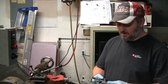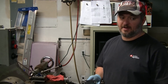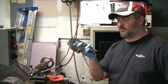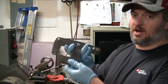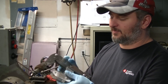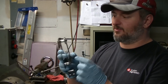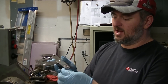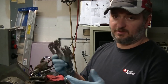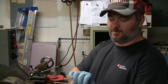As most of you may know, if you're following along in the series, my nephew Nick and I have been working on a project. This is his clamp that we've been working on. We used the stainless that I had been using on the CNC mill for the body parts of it. We turned 303 stainless for the different pins. I drilled and tapped this one. It's a different series — you'll be able to see all that stuff.